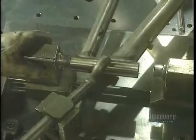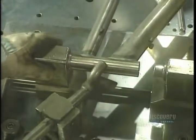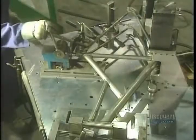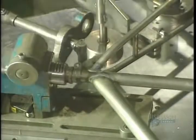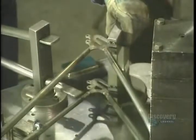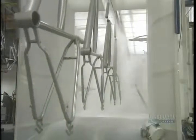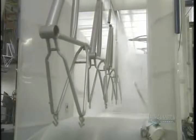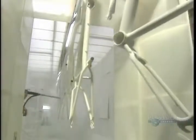At this stage, it's important to straighten the frame, which could have deformed during welding. They verify the alignment of the tubes and straighten it out cold with a tool that sets it to the right dimensions. Now they paint the frames. Paint is applied with a spray gun and adheres to the frame by static contact, then baked in a natural gas oven at 218 degrees for 15 minutes.